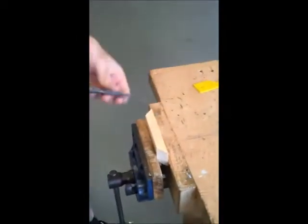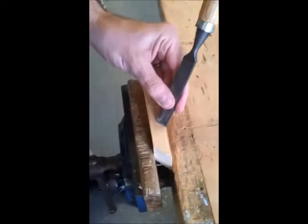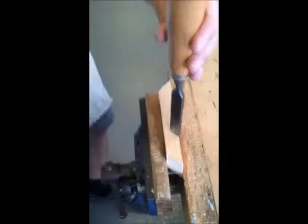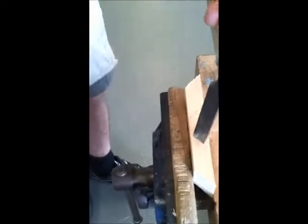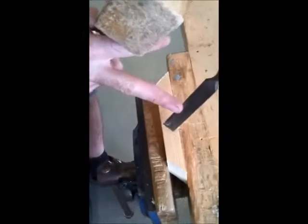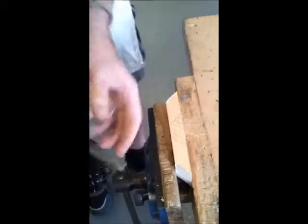The first job you're going to do is place the chisel on the waste side of that line. Hold it at the top, making sure it hasn't moved, and just give it a little tap with the mallet. You're going to move it down, putting this corner into the groove you've already created, rock it over, and two taps again. Advance it again, putting the corner in like so. Then we do the same on the other side.